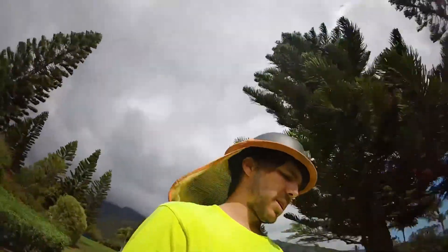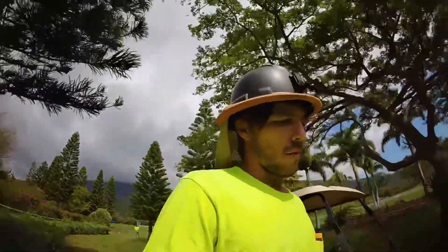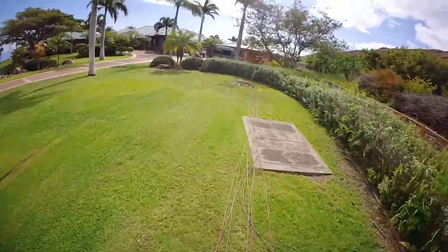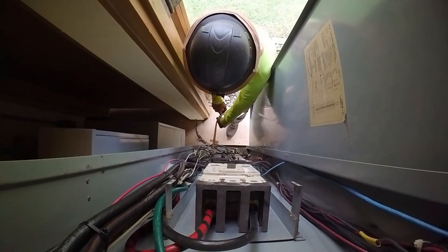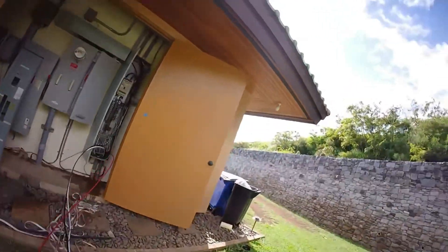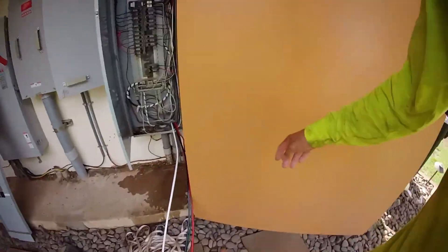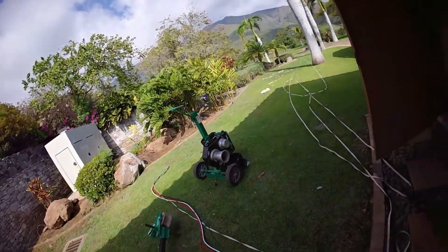The official reason that I'm not using the tugger in this case is just that the tugger is a huge tool and it's for big wire. The head physically wouldn't fit in the panel if I tried to put it in there. So that's why early in the day I decided not to use it — I could just tell it wasn't worth trying to set it up. This panel is shut off. You should never pull into a live panel unless you have the proper safety gear, like a 12 or 40 cal suit depending on the situation. One of the things about pulling the whole spool of pre-measured wire through all the way to one end is you might pull more wire than you need. The goal is not to pull an inch more wire than you actually need. In this case we did pull maybe 10 more feet than we needed.